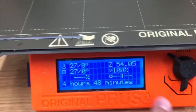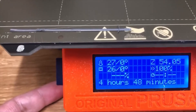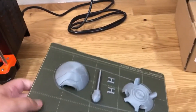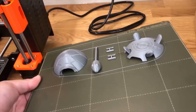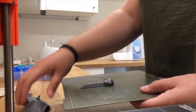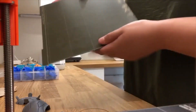When your print is done you'll see it says the time it took, that it was 100% successful, and that it's cooling down. You can see that the temperature is dropping. The machine will stop, and what you want to do is take off the ends and remove the print sheet from the board - you'll want to pop the print off the board so you don't pull or mess with it too much. To pop it off, you'll want to bend the sheet a little bit, and then the prints will be easily removed from the plate. Go ahead and take the brim off and then you've got a clean board.